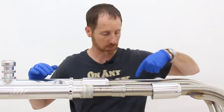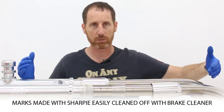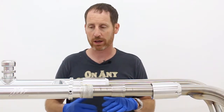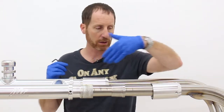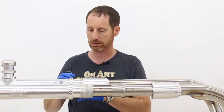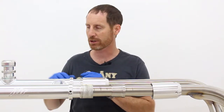And that's one of the reasons why we do these markings that you see here, these hatch marks, to let us know that we're evenly in on each side, okay? So that's why we do those little things like that. So now I want to talk about how you get things a little more formal as you go. So we've got our distances specifically where we want them. So what I did was I went ahead, before I tightened anything else up, I used my set screws once I'm in position to start locking the tower down and securing it.